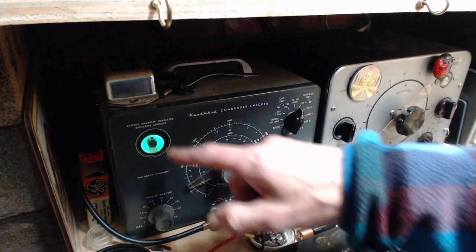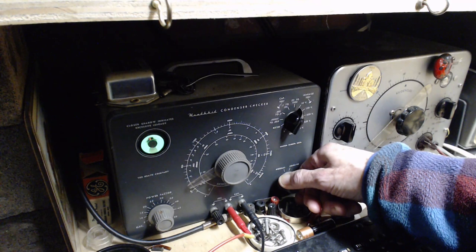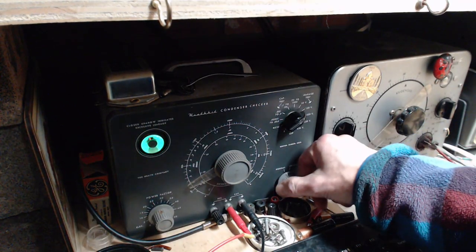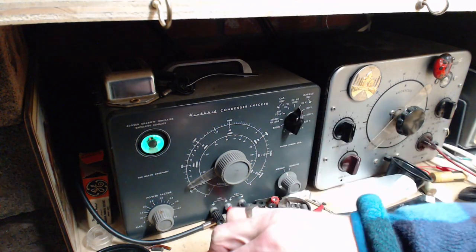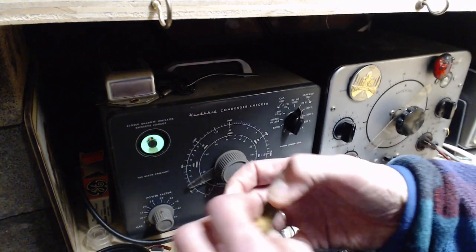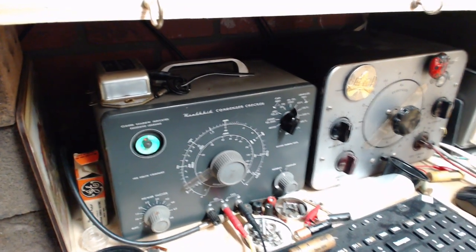Okay, 50 volts, watching the eye. What does it do? It's like the other one. It's opening up a fair bit. 150 volts, not gonna do it. So, somewhat leaky. This is a bypass, I believe, if I remember right, a bypass capacitor. Probably a little bit of a leak, doesn't really matter.